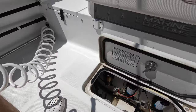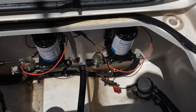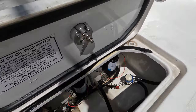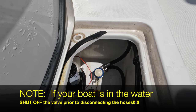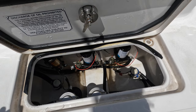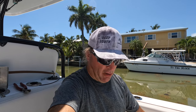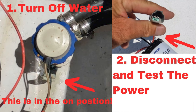I just washed down the boat because that was saltwater I dumped out of it. Here's the hose — pump's working, you can see where the water goes through that little screen area. Before you start your project, very important: the saltwater comes in off the bottom of the boat. If your boat is sitting in a canal and not on a lift like mine, you need to turn that valve off first or you'll sink the boat — as soon as you take that screen off it's going to start coming in. You've got four screws and basically three hand-tighten pieces to take apart and put back together. The hardest part on almost any vessel is getting into the hold. If you could drop something, lay a towel underneath to catch it.